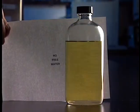This is an example of dissolved water in oil, which is more difficult to remove. Dissolved water is invisible the same way humidity is invisible in the air. While this oil sample appears clear, it actually contains 60 parts per million of dissolved water, indicating an unacceptable level of moisture in the oil and a clear sign of a high level of water in the transformer's paper insulation.